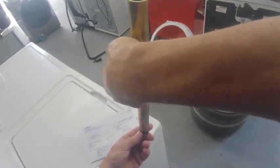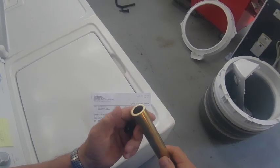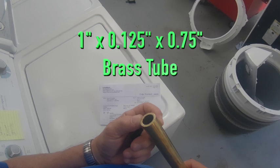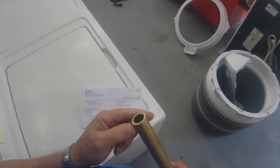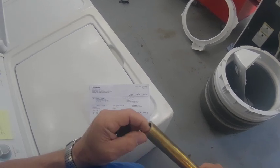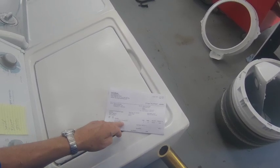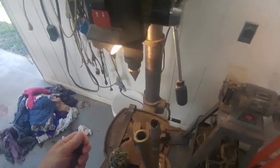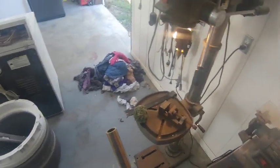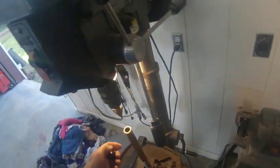If you look at it, it will fit perfectly just inside on top of this metal ring. The size of this pipe is one inch OD by .125 wall and a three-quarter inch inside diameter. What I'm thinking is to take this tapered bit and drill out the inside so this tapered part will fit in there snugly and the wall will fit right on the edge of that.